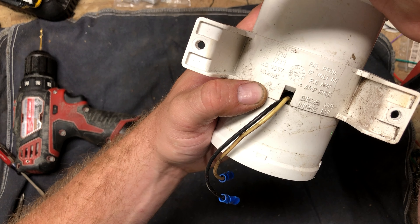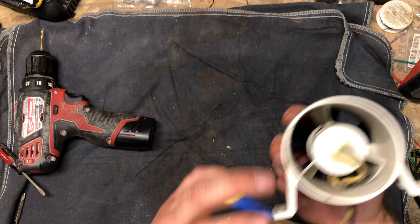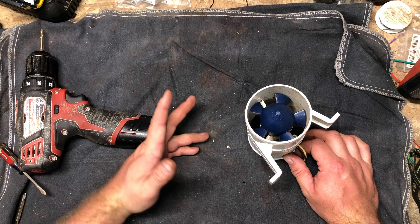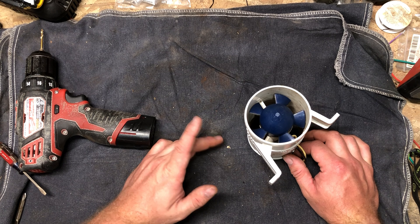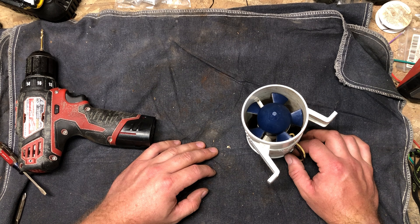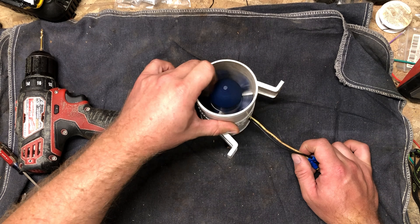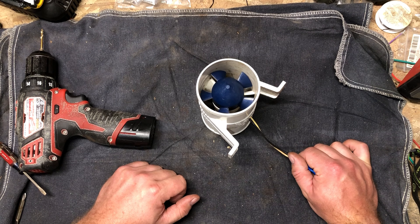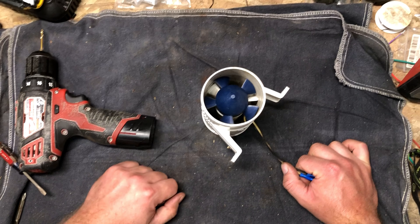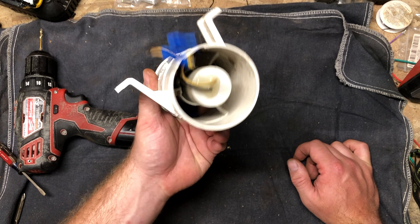Not a particularly powerful fan, around 30 to 35 watts. For those of you not familiar with boats, the engine compartment is relatively sealed. There's an air inlet, but when the boat sits, fumes can build up in the bilge area where the engine is. The theory is that running this fan circulates air through the bilge and removes those gas fumes, so when you go to start the engine you don't potentially have a fire break out.